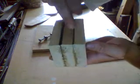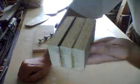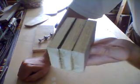and when we drill the holes for the bearings and the shaft, it will be 90 degrees inside. It should be more or less square, which we are going to plane now by hand. If you have any possibility of using a professional machine, it would of course be easier.